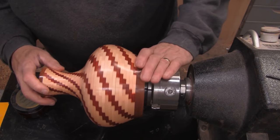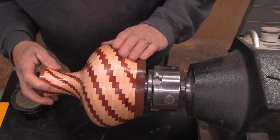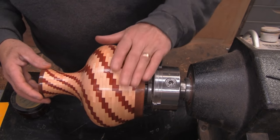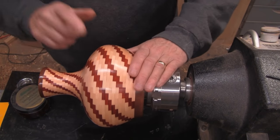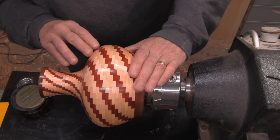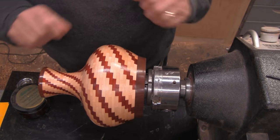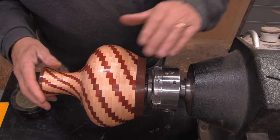It's been a week since I sprayed the last coat of lacquer on this. I will say that I sprayed between 12 and 15 coats — that's as close as I can guess. I really don't count how many times I do it; I just look for when I have a finish that I'm happy with. I am happy with using real light coats on it to begin with to keep it from bleeding, because I tested a piece of this and not even touching it, but just spraying it too wet, the padauk would bleed right across into the maple.